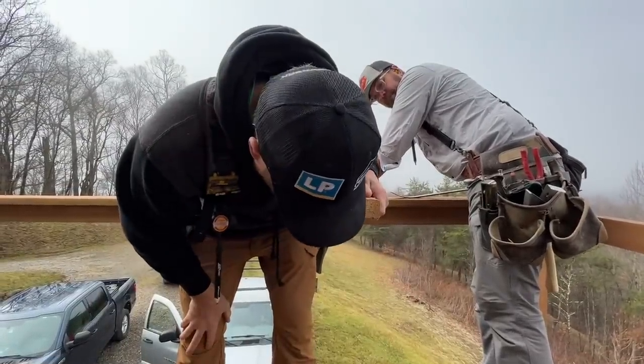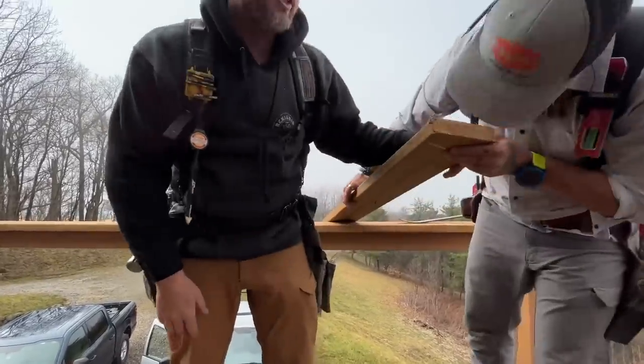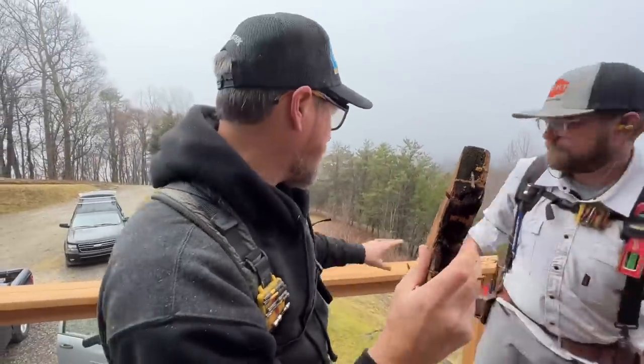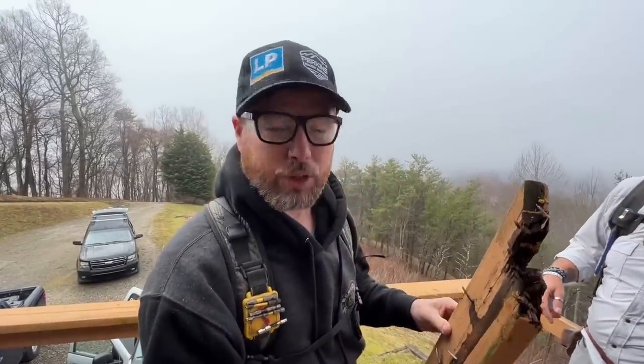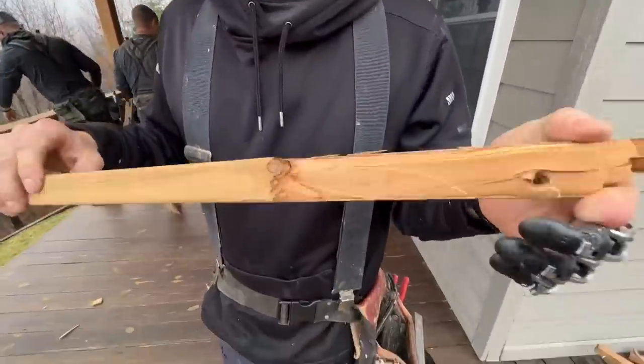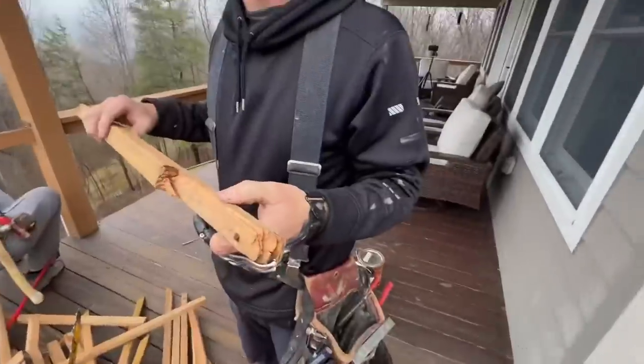Is it cedar? Smell it. Yep, that's cedar. After this smell test, we determined that these top caps were cedar, which is way more expensive to buy in this area, so we don't see people doing that a lot. They do look nice and clean, though. This one's still rotted on the end where it could soak up water through the end grain. We'll have to replace a couple of these, but the covered ones that are good, we'll just reuse them. Cedar is pretty good for exterior. These pickets are cedar too. I've never seen cedar pickets available locally. So he can use this as kindling and make a nice campfire. You're not supposed to burn pressure-treated wood because of the chemicals in it. But cedar, man, is the best kindling ever.